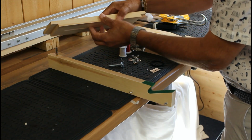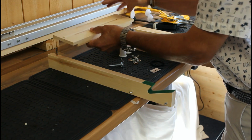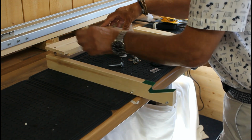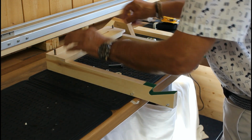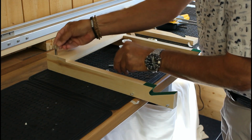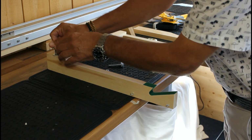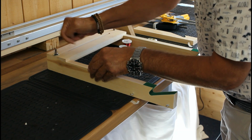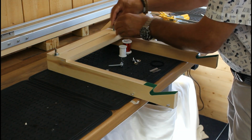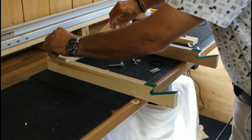and then we've got a slotted piece of timber here, and that's got two holes so that they fit nicely over the threaded bolts at the end of the support frame, and that just drops into position like that, and then we can secure those in place by using these washers and wing nuts, and that just gives the whole support frame a bit of stability. Do those hand tight, so we've got one on each side, so that just supports it. Quite easy to put together, quite easy to do.